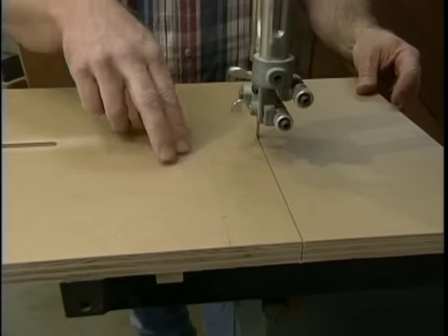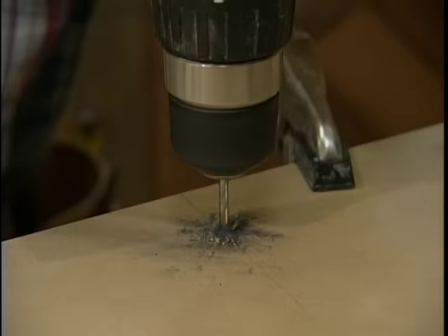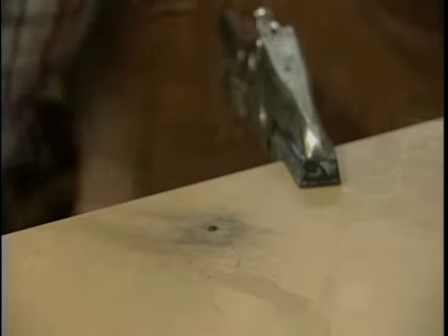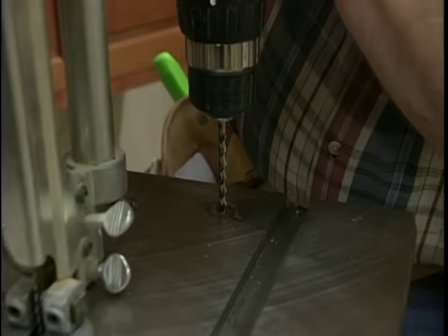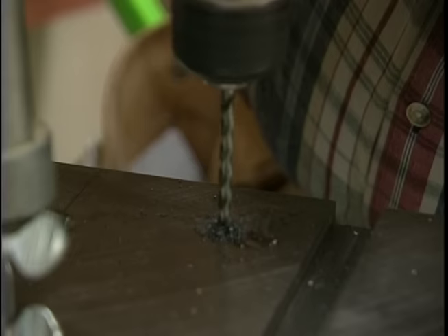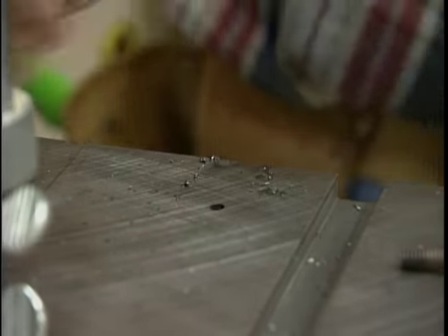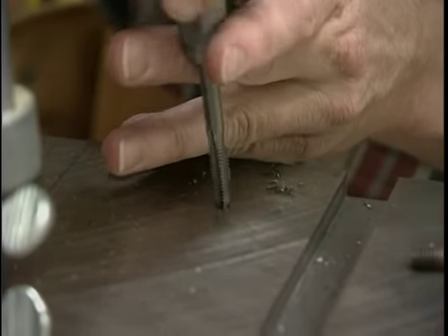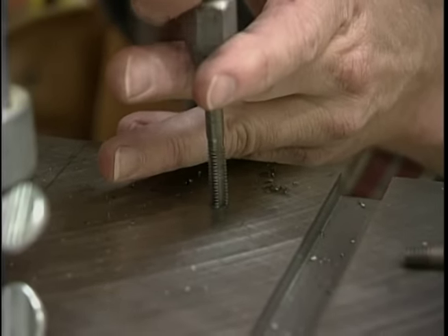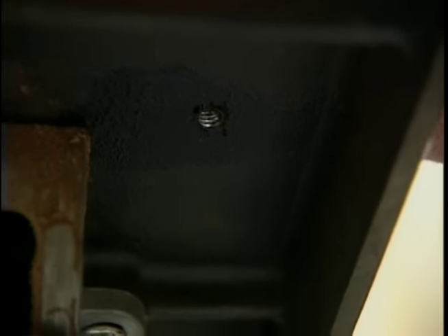The next thing to do is to attach the jig to the cast iron table. So I'm going to clamp it in place and then drill some holes all the way through the plywood and the metal. The first pass with the drill was just a pilot hole; now I'm going to a larger bit. I put a little bit of oil for lube and drill all the way through. Now I'm going to tap it for this bolt using a tap that you can buy at any hardware store — just start it in, feel it bite, back it off to get the waste out, turn it a little more, and so forth until we get all the way through. If you didn't want to go through this process, you could drill a hole large enough to put a through bolt with a nut.